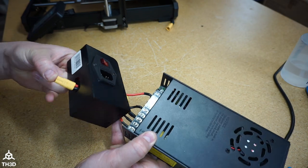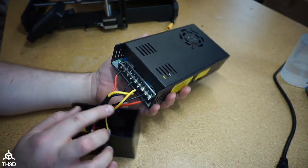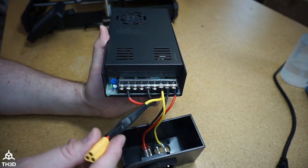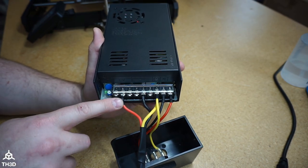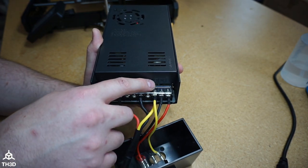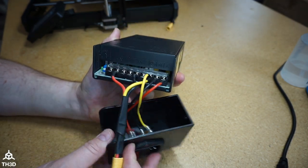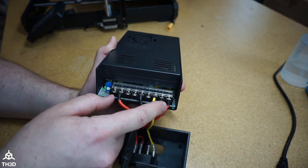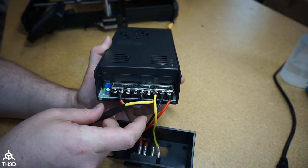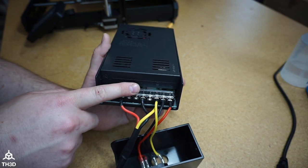Now the cover will come off. Go ahead and pull the connector through the bottom and take note of where the connections go on the power supply. With the three-pin plug, we have the red wire going to V-plus, black wire going to V-minus, and the yellow wire going to the ground terminal. On the AC side — these thinner wires go to the receptacle — the red wire goes to Line (L), black goes to Neutral (N), and the little yellow wire is for ground.